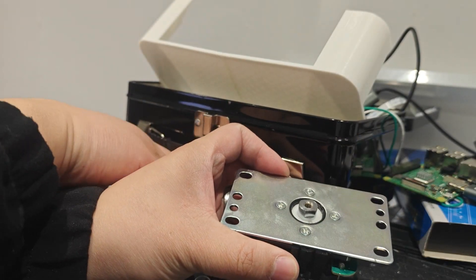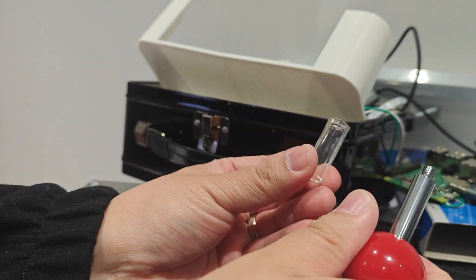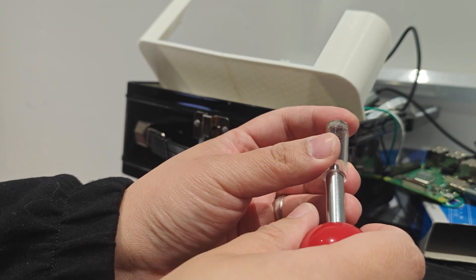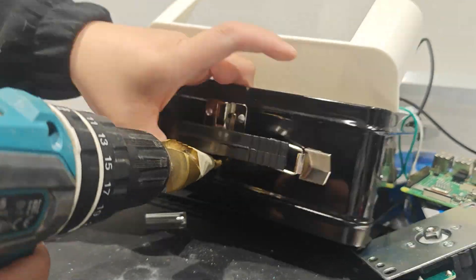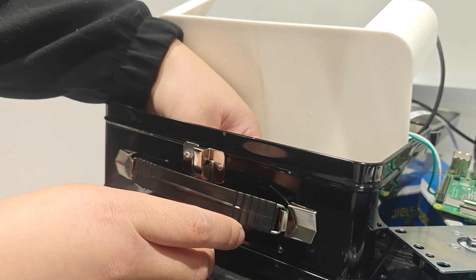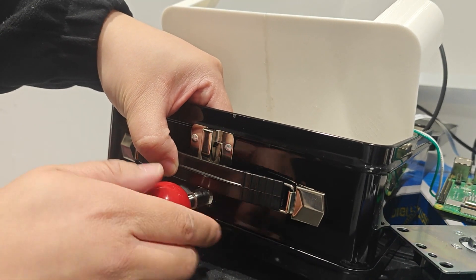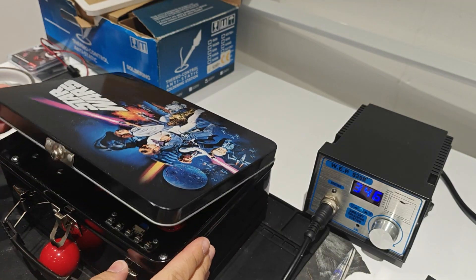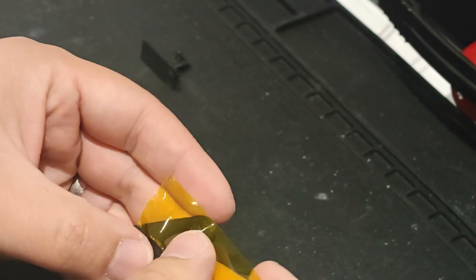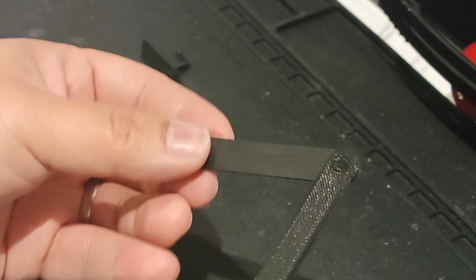Looking online, I did find a different joystick which was a screw-fit joystick and not using a latch system. It also came with a plastic piece in the box — this was perfect as I can glue a bolt at the end and attach it to the lunchbox. The main thing for this lunchbox arcade to work is having a detachable joystick, and having the joystick situated somewhere on the lunchbox means you can carry the lunchbox arcade wherever you want. For the hinge, I made a few designs but came up with this in the end. Using the solder iron and Kapton tape, push each rod through and melt it until it's sealed onto each leg and hinge.